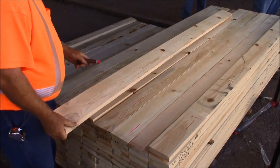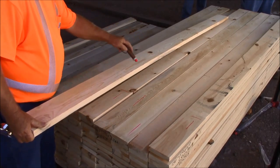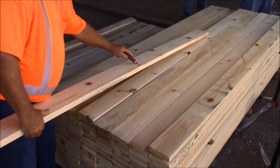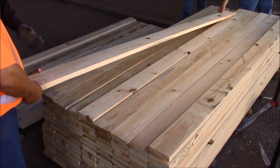Here we have a manufacturing defect. We can take either finger joint or we could take window sash cutting. Another finger joint, or we could take sash — either way we wanted to go on that board, it would cut out really a nice 3 shop.